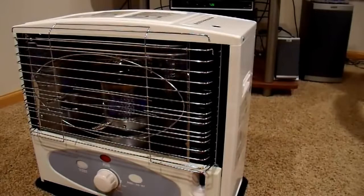I'd mentioned that carbon monoxide shouldn't be a problem as long as it's burning properly. But there are other safety concerns. This is a fairly well-sealed house that I'm in. A typical residential building will have one air change per 2 hours or so. The extremely tight ones might take one air change every 10 hours. Air change meaning that the house leaks air.